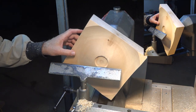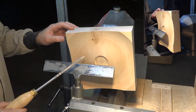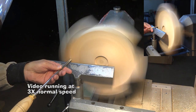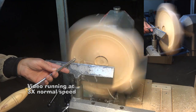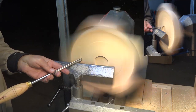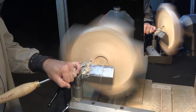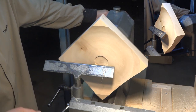I'm going to come in here with my quarter-inch bowl gouge to see if I can clean it up. With this thin shaft it's going to tend to bounce a lot more than the three-eighths would, so I just want to stay on the inside and do a very light cut. I've still got some chip out, but it's bouncing badly — that's not the solution to this one.